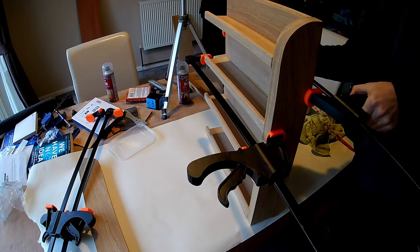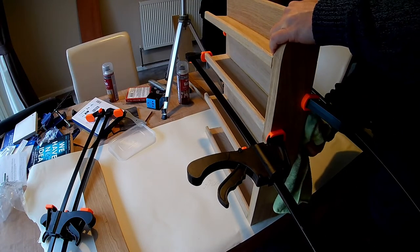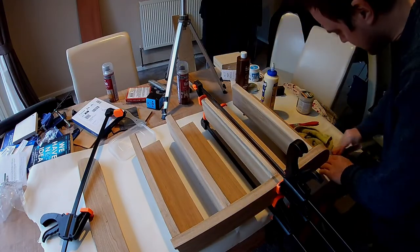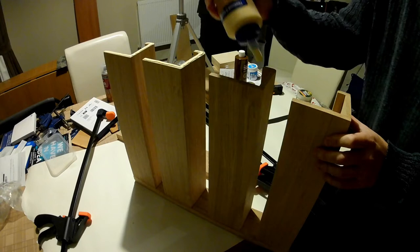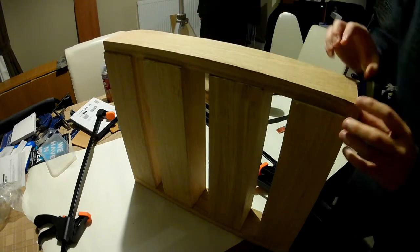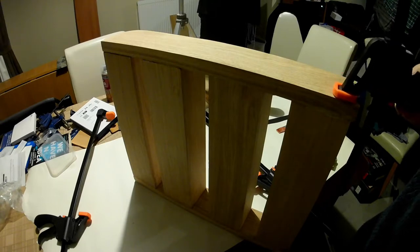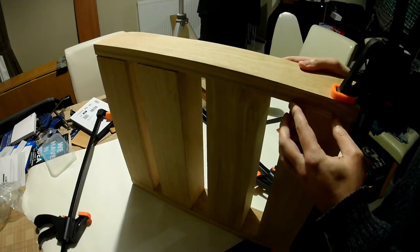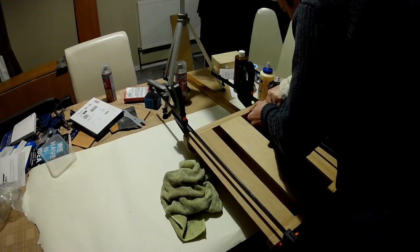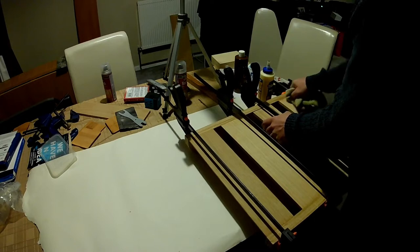Now that I had plenty of clamps available, I could use a pair of them to make sure there was plenty of pressure on the glue and ensure it would be pressed firmly into place. Finally, I wiped off the squeeze-out — it turns out a small steel ruler makes a great tool for getting it out of those awkward angles. Now to wait again while the latest glue-up dries. I applied a coat of glue to the ends of all the shelves, brushed it to even it out and then placed the top in place. The tricky part was making everything line up — I needed to get the shelves to all sit straight and make sure the side lined up perfectly along the back, all whilst making sure that nothing shifted while I clamped it. This was probably one of the most awkward and fiddly parts of the entire build, but eventually I had it all clamped up. My tip for you: you always need twice as many clamps and twice as many hands as you think you do. Eventually everything was in place and I cleaned up the glue as best as I could.